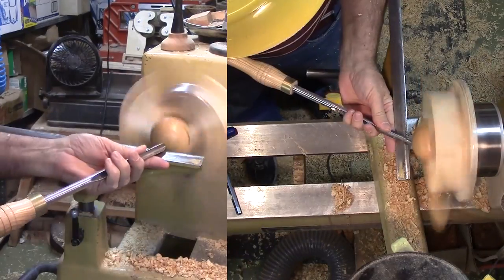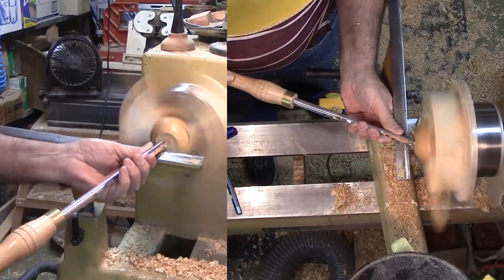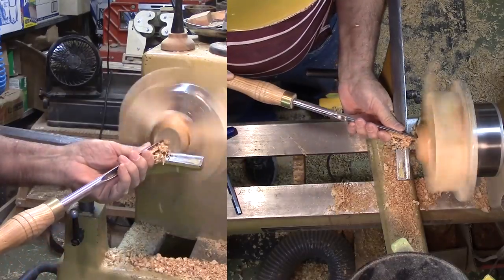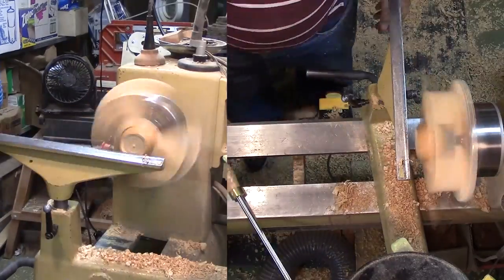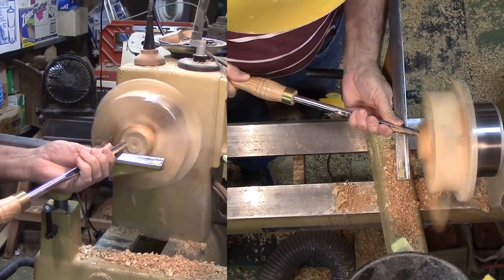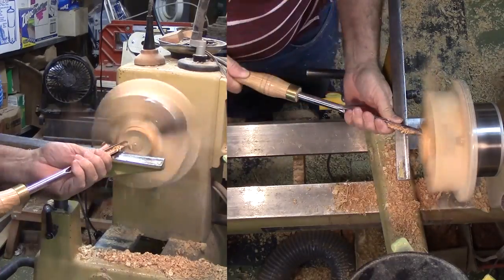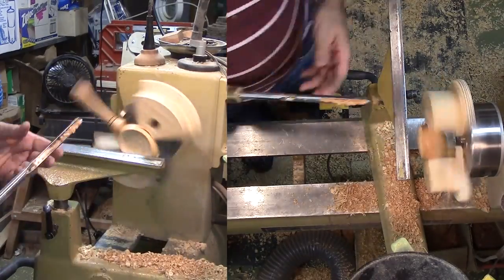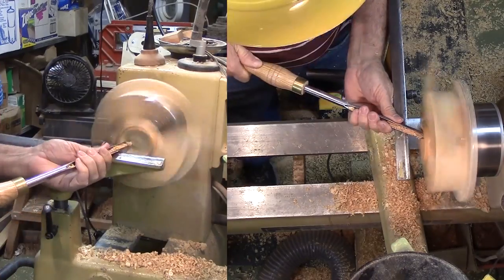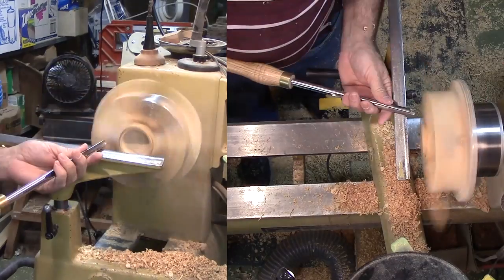With the bowl portion oval, it's tough to mount the wood to a metal chuck without significant damage. That's why I made these wood jaws. I've mounted the wood in the wooden chuck with two jaws removed. I've angled the handle just a little bit off horizontal, then on to hollow the bowl portion. Easy does it with that handle flying around. Even though I don't need the long tool rest, I'm using it anyway so that I have a good barrier between me and the handle.